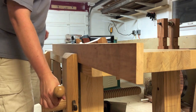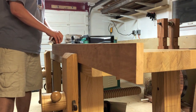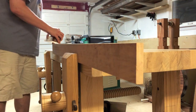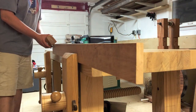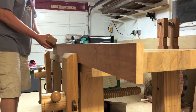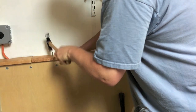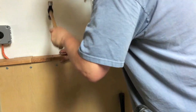Now I just want to break the edges. I ended up putting just a slight round over on the bottom and a little round over on the top, done by slightly changing the angle of my chamfer. So it's a round over — maybe a faceted round over — but it ended up being exactly what I needed to give me that nice soft feel on the edge of my cap rail. Then it was just a matter of installing it all the way around with a little pre-drilling with pilot holes, using Tremont nail cut nails to install it all the way around the shop.